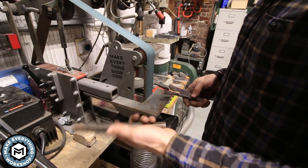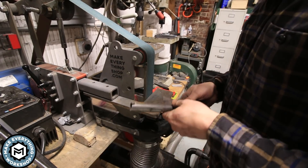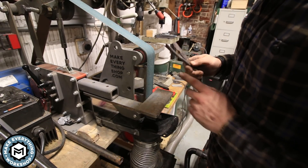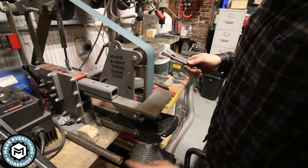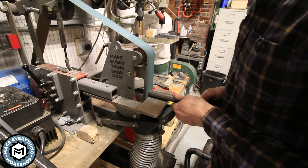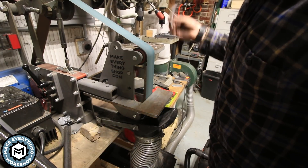I've got a piece of mild steel tubing here and the titanium pieces I was just working with. The important thing to pay attention to is the sparks. Titanium sparks white hot and sparks abundantly — there are a lot of sparks that come off this material. I'm disengaging my vacuum because I don't want those titanium sparks going into it since they burn so hot. I'm setting up dust collection into a water bucket. We'll start with the steel and then try the titanium.